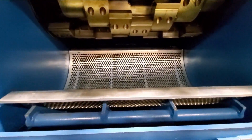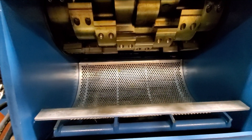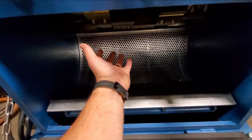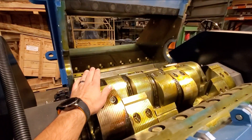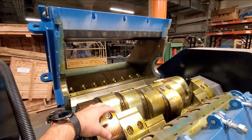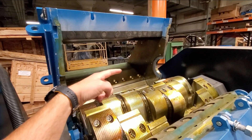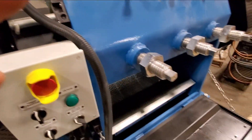This here is the screen cradle, which goes up and down hydraulically on this particular unit. Some are just jack screws or a crank to open and close, but this one's hydraulic. The screen sits up in here on the bottom, and the material gets cut between the rotating blade — we call it the fly blade — and the bed blade. It then falls down into the screen. If it's small enough, it will fall through the screen, which is what you really want. If not, it comes back around and gets another shot at getting chopped, again and again until it's small enough to fall through.